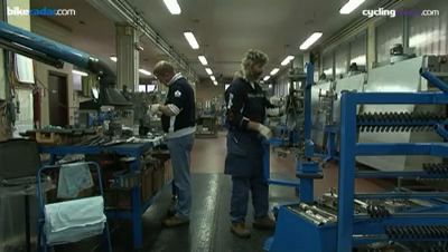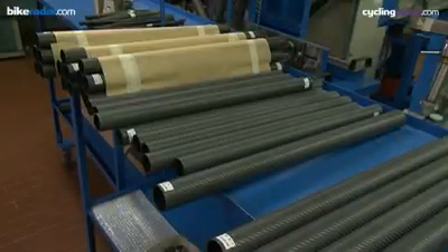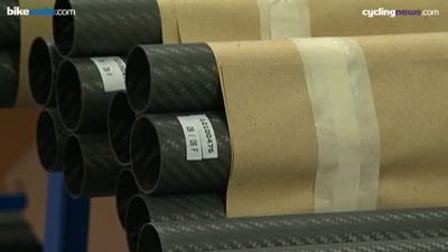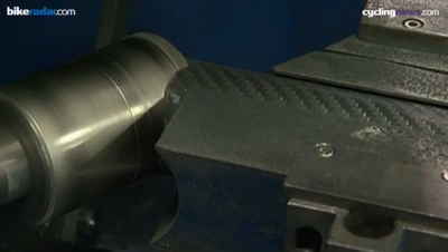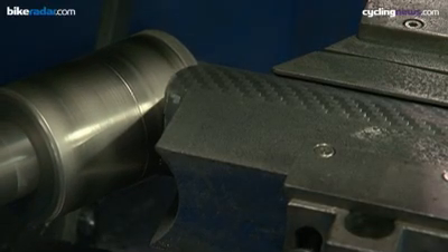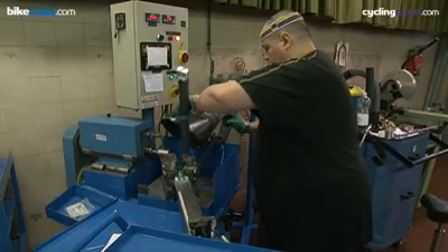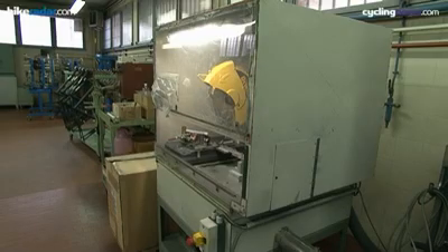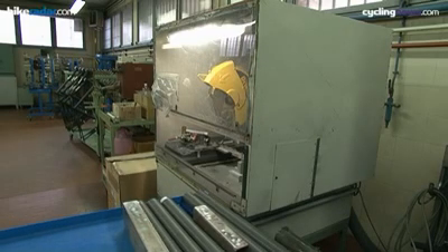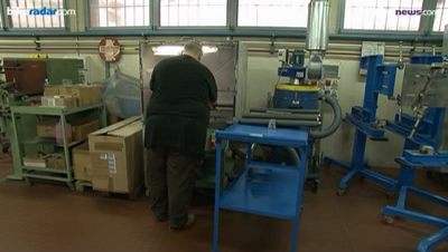In this installment we'll be taking a look at the construction of the top of the range Colnago EPS frame. The bare tubes have to be prepared before frame construction can begin, and the first step is to miter the ends of the tubes using a miter cutting machine. This relatively simple machine shapes the end of the tube in such a way that it will fit up against the next tube in the frame, allowing maximum overlap of the tubing into the special lugs that they'll then be inserted into after trimming to length.